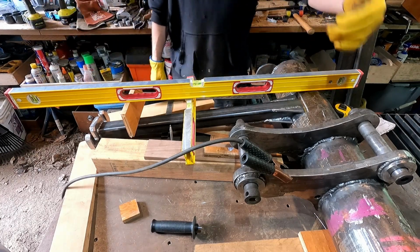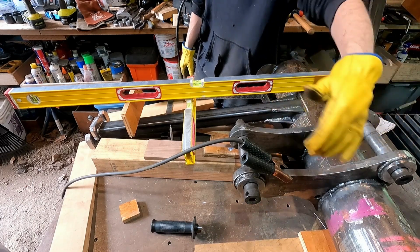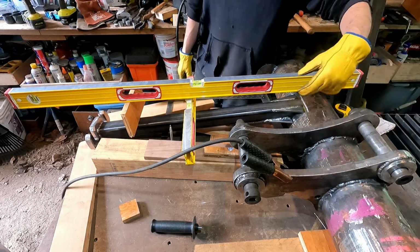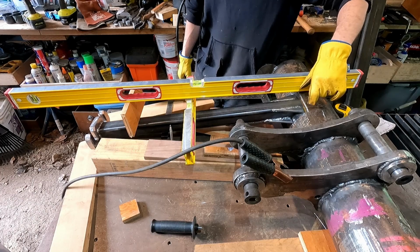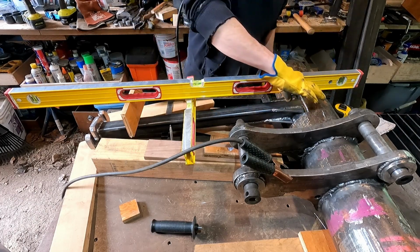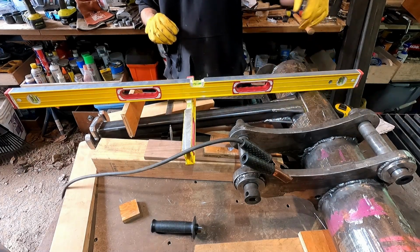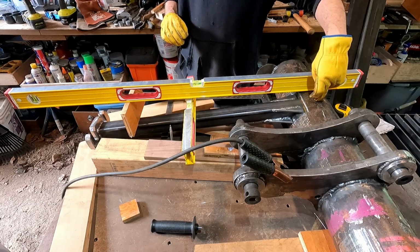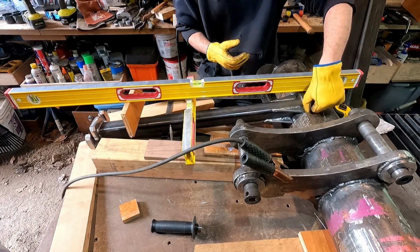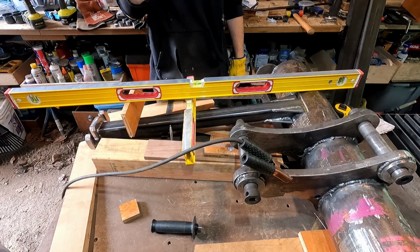So I know that there's 17 and a half, or the 19 and a half pitch, 17 and a half inside to inside. And so I could lay it out from the center line of the lugs here and scribe 2 lines where the sides of this tube go. And I knew that the top edge of this tube was 0.596 down from the apex of the tube. So I got a level and calipers and I scribed a horizontal line there. So I'm able to get that where it needs to be.